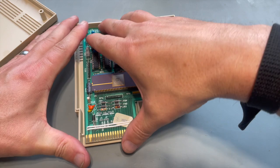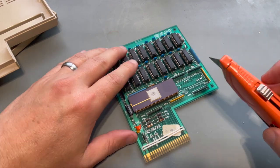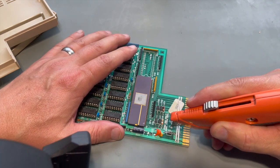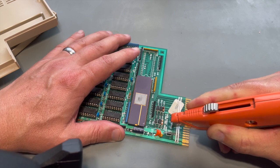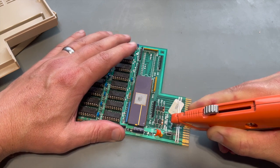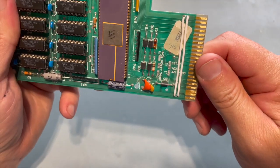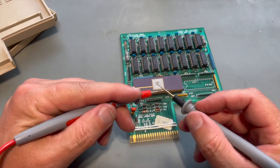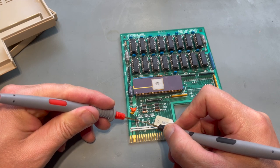As expected — so I'll grab a utility knife and cut that jumper at J1. I think that should be good. I'll confirm using the continuity testing function of my multimeter. I touch the leads and I get a beep, then I touch both sides of J1 — no beep. So we're good.